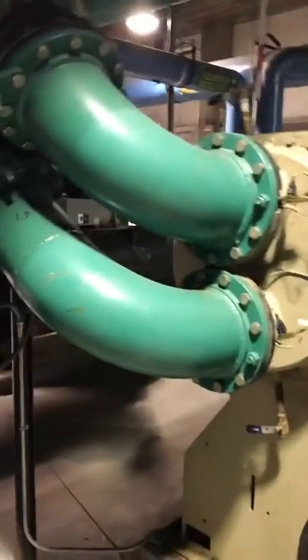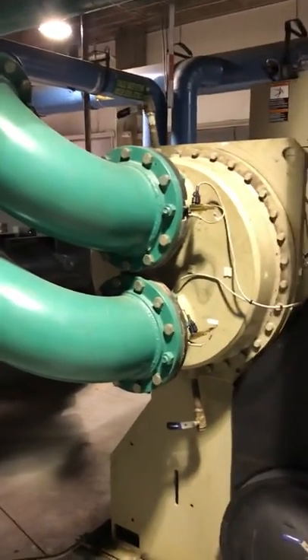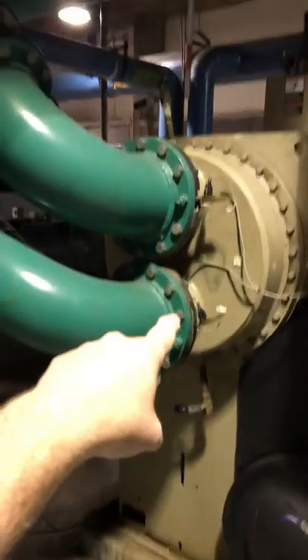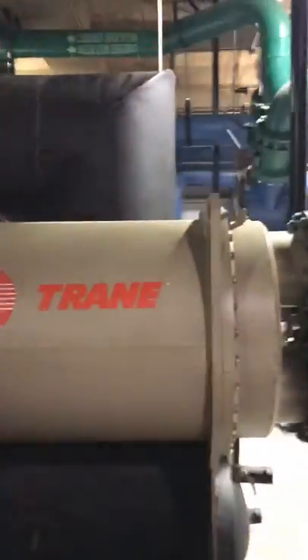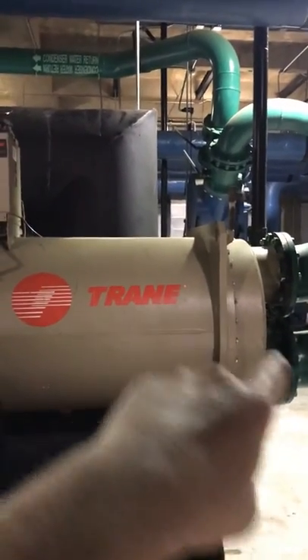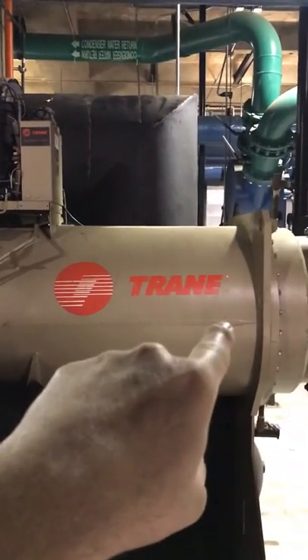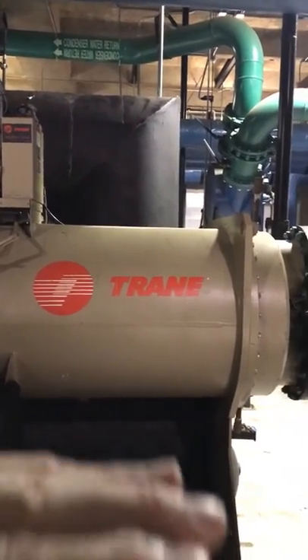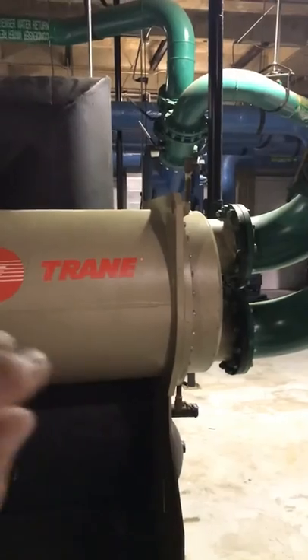The cool water that came from our pump and our cooling tower comes down into the bottom side of this heat exchanger — this chiller barrel. This water flows across and back up. The chiller barrel is basically cut in half: water flows one direction, spins at the end, comes back the other way, and out to the cooling tower it goes — through the 200 tubes.